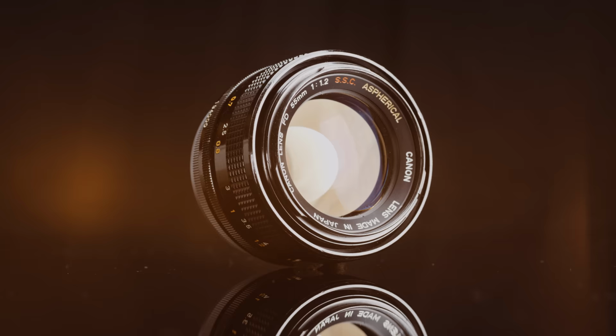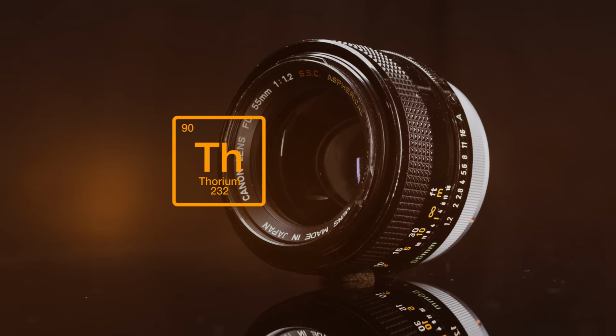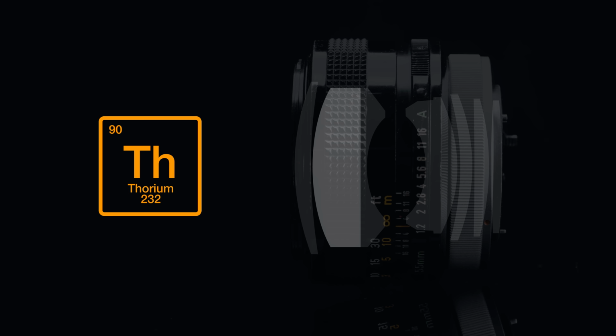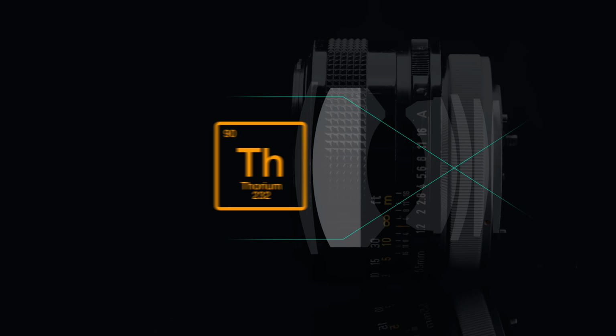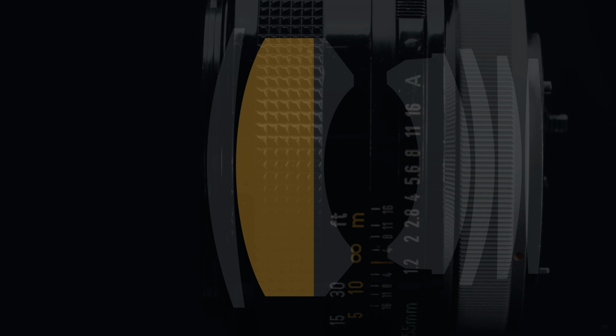Like many other brands, Canon used thorium to spike lens elements. Thorium is an abundant, naturally occurring radioactive metal. If mixed into glass, it changes the index of refraction of glass while maintaining size and thickness, as well as low dispersion. This allows for low aberration and distortion with simpler, lighter and cheaper designs. The amount of thorium inside the glass is much higher than one would anticipate, considering that thorium is a metal and opaque. It can contain up to 30% by weight in thorium.